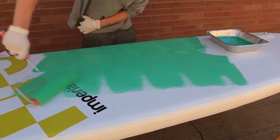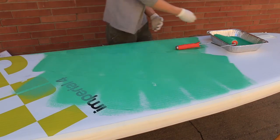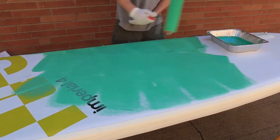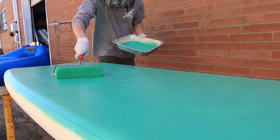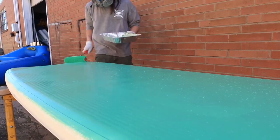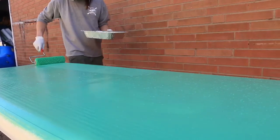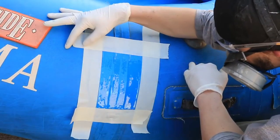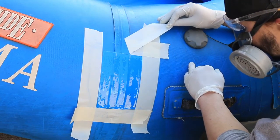Urethane cures slowly in good weather — 75 degrees Fahrenheit and low humidity. It cures slower in cool weather and faster in warmer weather. In ideal conditions, allow 10 days to fully cure. If System 6 Accelerator is included, it will reduce this time to 4 days, but no less. During the cure period, do not allow the urethane to touch itself — do not roll the boat. Leave the boat inflated, but not to full pressure, and unmoved until the urethane has fully cured. Note that even though the urethane will be dry to the touch in just one day, it is not fully cured. Do not leave in direct sunlight.